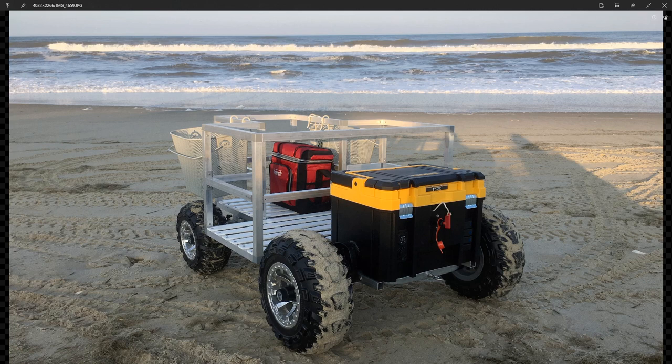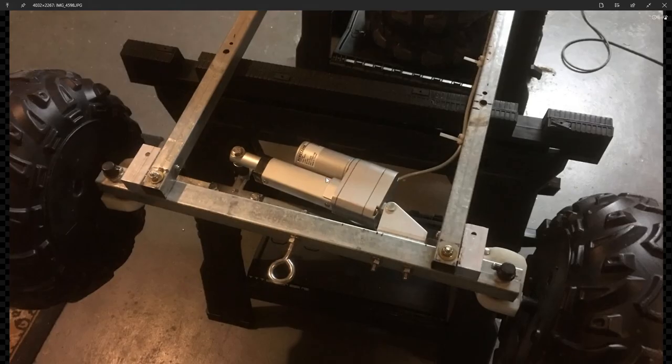I'm going to assume that you've already seen my videos about the control arm with the, using the remote, the RC remote. But this is the setup here. And this is a ServoCity linear actuator. It's an actuator as opposed to a servo. The actuator has a built-in potentiometer that sends a signal that tells in what position the push rod is: all the way in or all the way out and whatever it is in between.